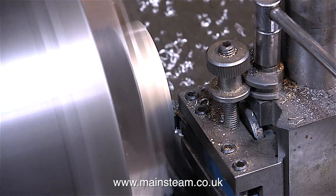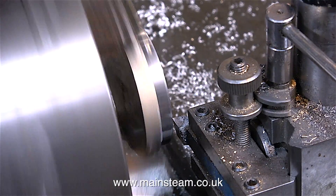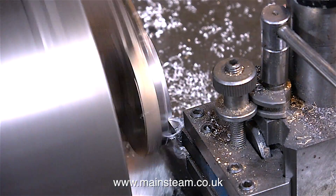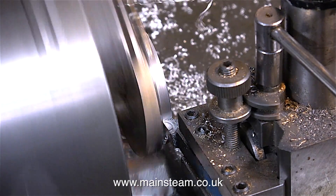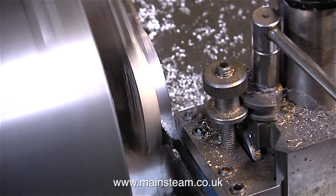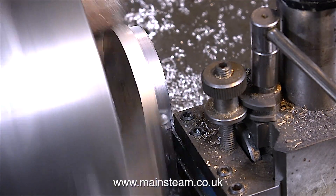The first part of the job is to take a facing cut across the aluminium bar. Once I'd faced the aluminium bar stock, because I was cutting on the outside edge, I slowed the lathe down. This is the part of the aluminium cap that fits into the copper part, so I need to turn this to an accurate fit - it needs to be a smooth push fit into the top of the copper, not too tight and not too slack.